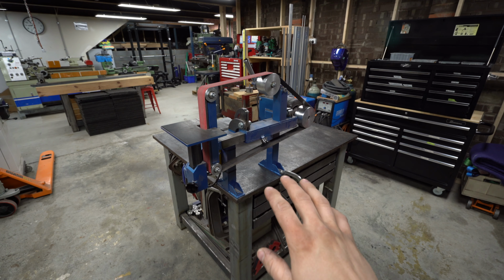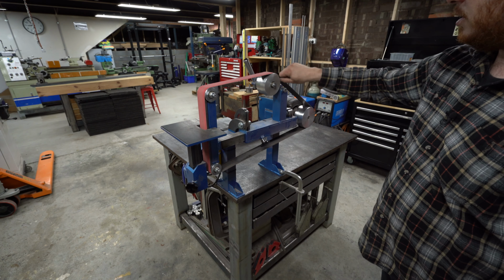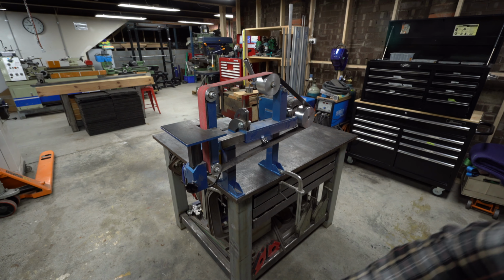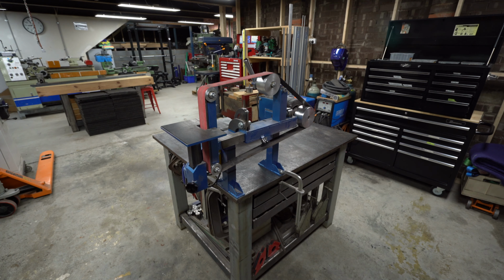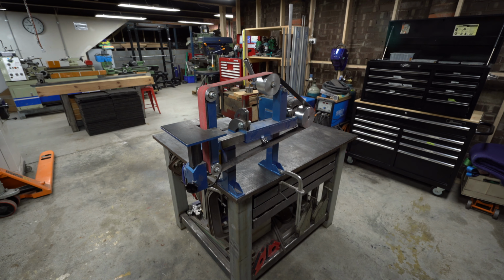This grinder, as I mentioned, had a motor problem, and I'll show you that. As you can hear, the switch gear inside the motor that enables and disables the starter winding is dead. It's like a plastic cage thing, and it's all just fallen to bits, and it's just too old, and I'm not going to be able to make one, I don't think. It's an injection molded part with lots of little features, and I guess it has to be non-conductive too. But anyway, I'm going to move on from that motor.